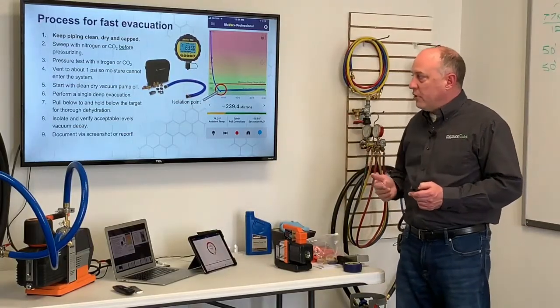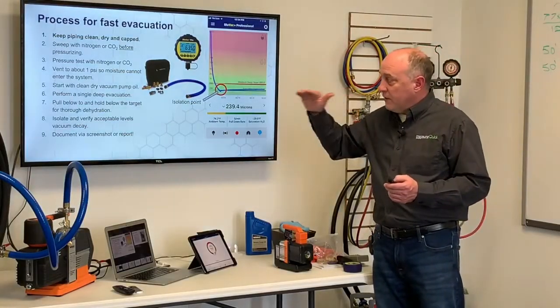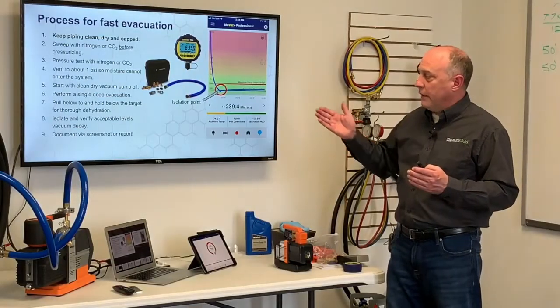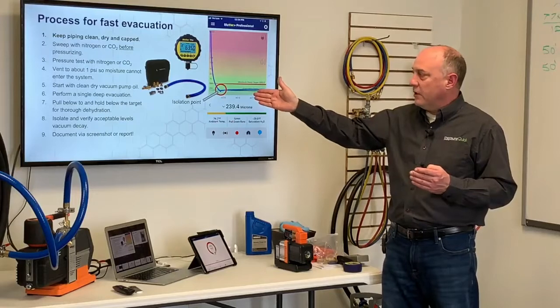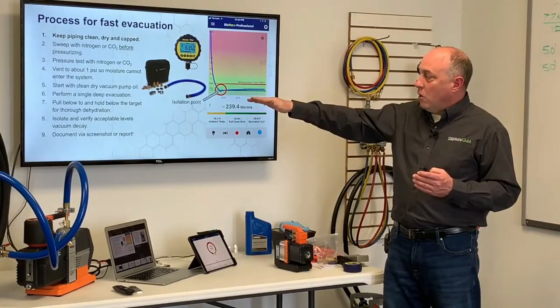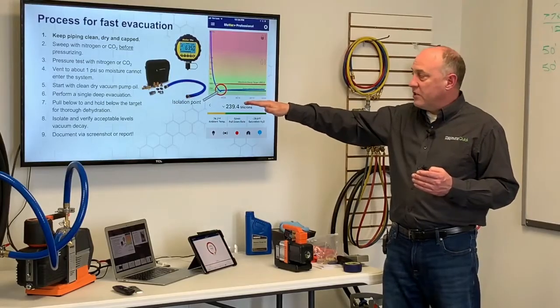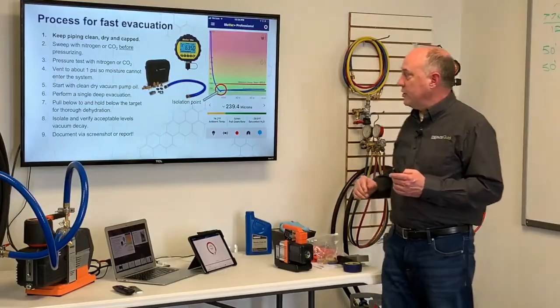We want to start with clean, dry vacuum pump oil. And my recommendation is always perform a single deep evacuation. I'll tell you a little bit about triple evacuation a little later on in the presentation, but there's no reason we need to do a triple evacuation. We want to pull below and hold the target for a thorough dehydration. We want to get that moisture out of the system. We want to isolate and verify acceptable levels, and then document via a screenshot or report.